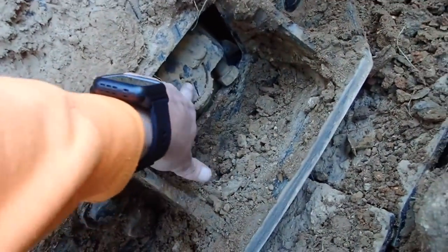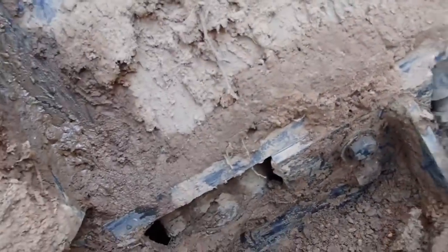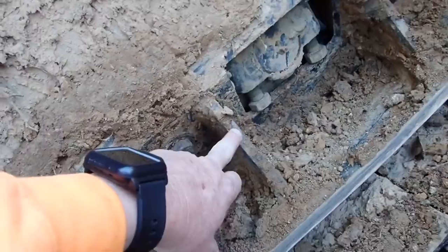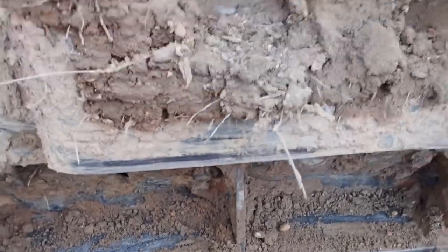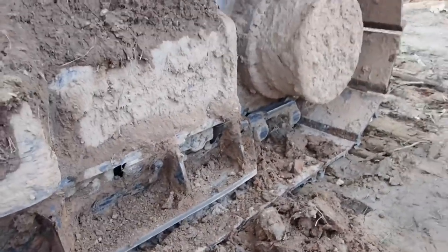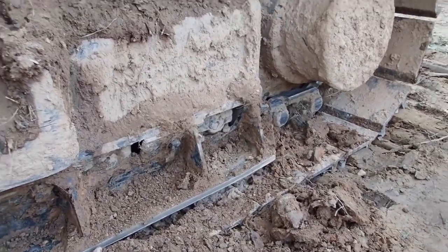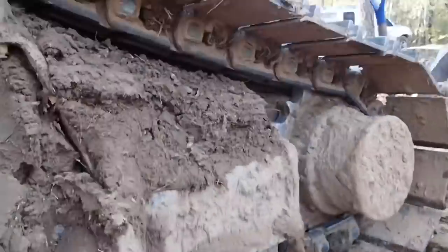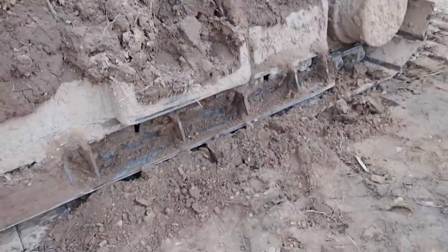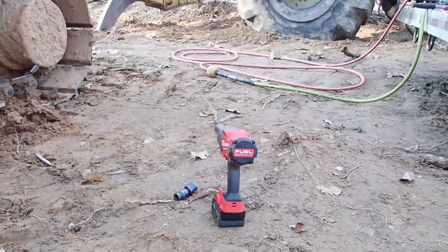This back roller is complete. The bolts are completely out of it right there on both sides. We got to drop the rock guards, which run from here, the half right there, on the outside, which is where we're at now, and on the inside too, to get the bolts out, where we can run a tap up in them holes and clean them, make sure they're good and clean. First thing I'm going to do, I'm going to jump back up here and pick it back up in the air, and then we're going to get the party started with the high torque impact right there.